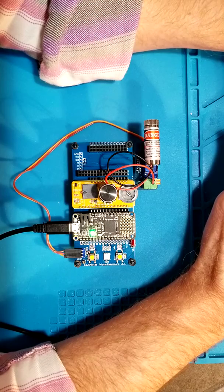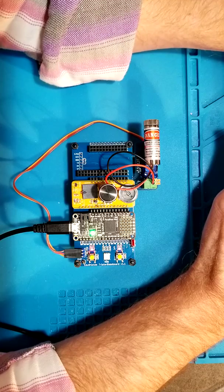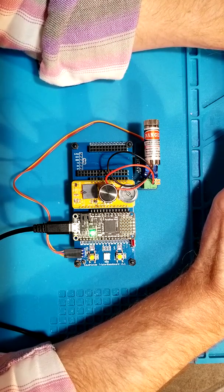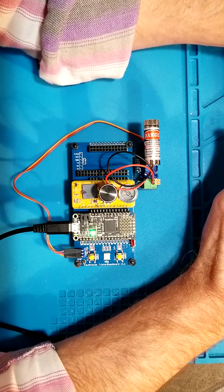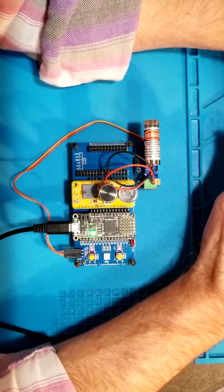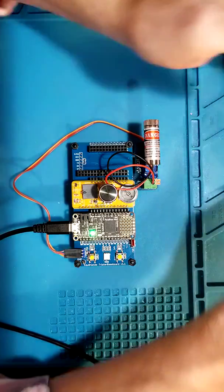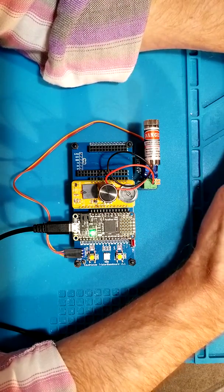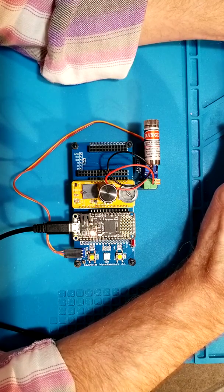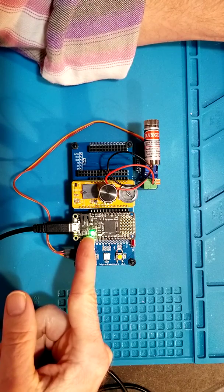Now, I told you that not only does it flash the LEDs, but it prints out some messages. The problem is we miss those messages because the program started, it printed out those messages, and those messages are gone. We don't see them in this window because the window was opened after those messages were printed. So if you remember, I told you it was easy to restart the program just by changing code.py. So if you click back in the code window and you hit save, the board recognizes, and if you could have seen that LED flash.